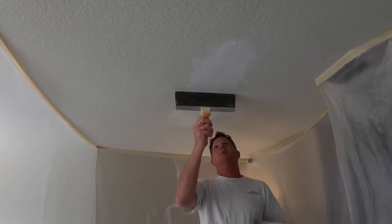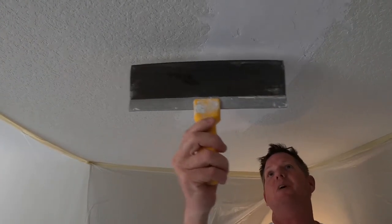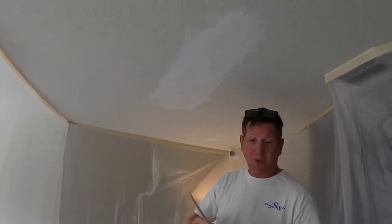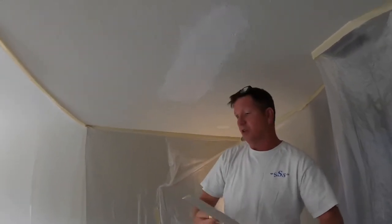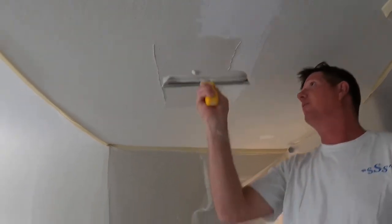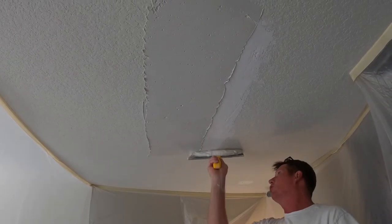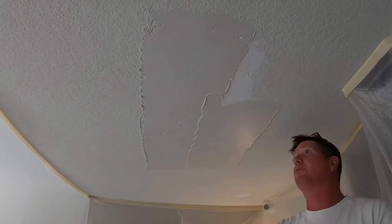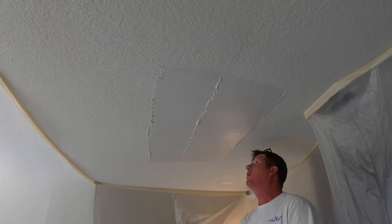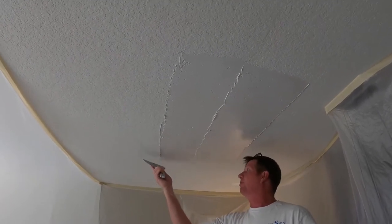So your indicator is here. You can see how the knife is rocking and you've got daylight on both sides - that's an indicator that we really need to put more mud on it. So what I'm going to do is what's called Bust It Out. We're going to go both sides, 12 inches on each side. Taking that feather edge, you're just putting two or three inches of your six-inch knife on the outside.